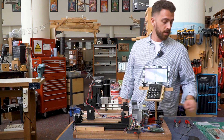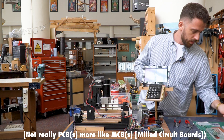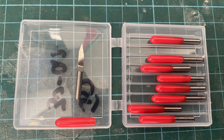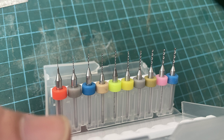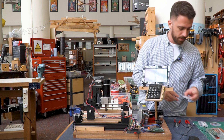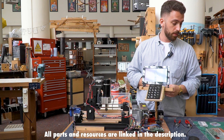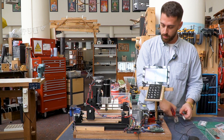For this machine I use copper clad PCBs, single-sided. I use a 0.2 millimeter tipped, 30-degree angle cutting bit for the traces. I use anywhere from 0.3 to 1.2 millimeter drill bits for cutting the through holes, because I use through-hole components rather than surface mount in most of my designs. This is the end mill bit, which is responsible for cutting out the profile of the final PCB after it has been traced and through-holed.